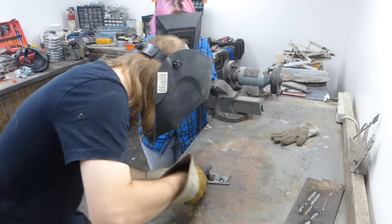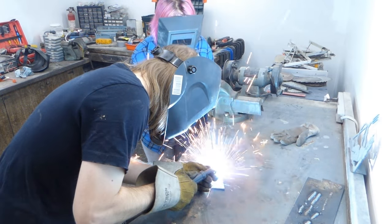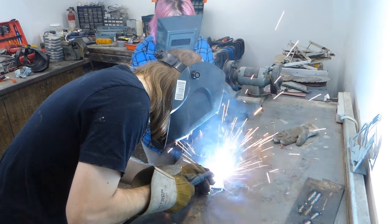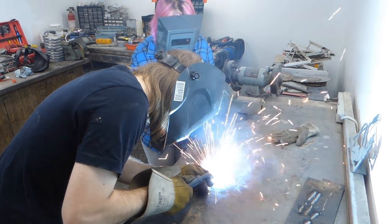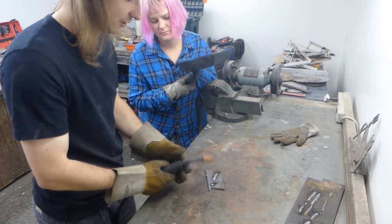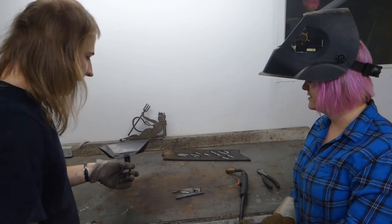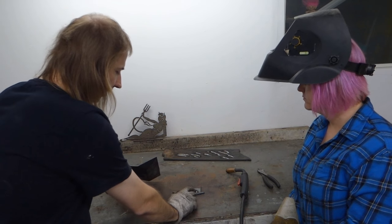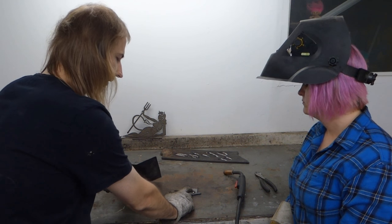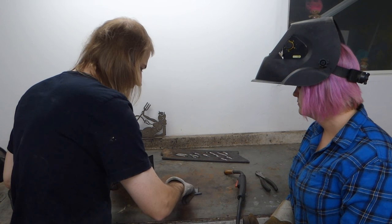Yes. And then we can join them together. And the welder's too hot and too much wire for this material, but that's the basic idea. And now to finish what you said. Yeah, you can finish that off just so you can see how you can move the torch when there's an actual seam. When you do your circle, instead make it a bit of an oval, and make the oval cover the seam.